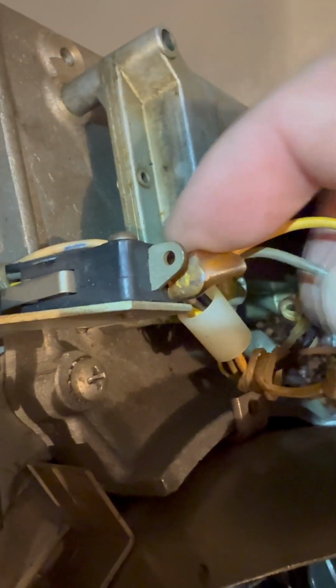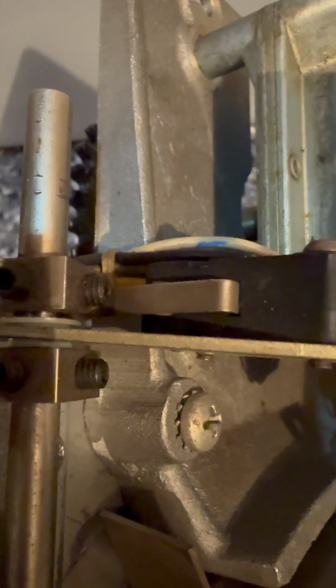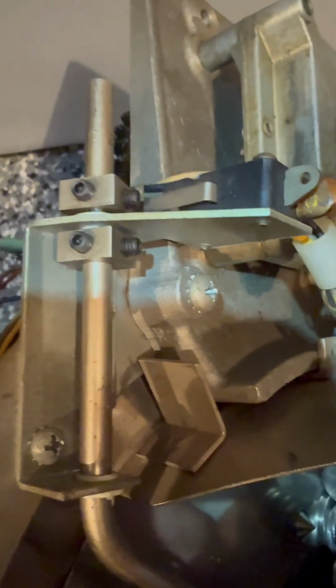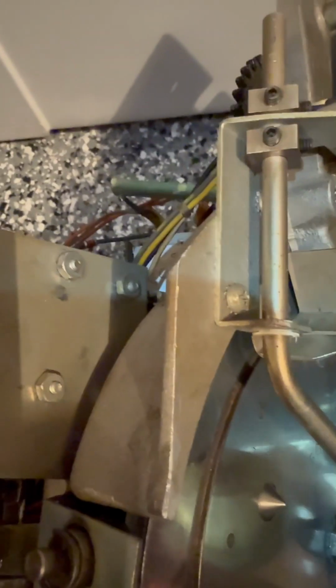So this comes in to this switch, right? And if this is full, and this thing is up, you can kind of hear the click. Maybe not. There it is. You can see the white thing going up underneath it. So this is pretty much doing its job, but it's closing it. If anything, I'd be more suspect about it not being open when it's getting full, but it's closing this. So this should be connecting the power through it. It's a heavier duty switch, so it should be handling the voltage. And this is down, so there's definitely not too many coins in there.